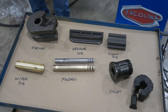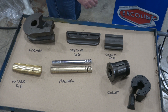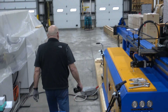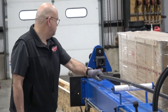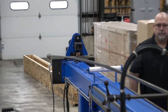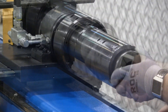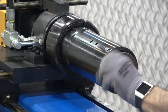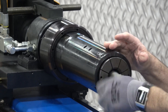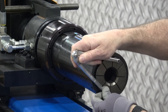First, we're going to go ahead and mount the collet in the machine. All the tooling is off the machine and the area is open. I can mount the collet into the tailstock. In this case, ERCO 65, I'm going to take this collet. I'll go to the rear of the machine first and pull the drawbar back so I have room to get the collet in. The collet is going to thread into the tailstock with a very fine thread. There's a spanner wrench that we supply with the machine to tighten the collet in position, using the spanner wrench pin-hole locations to lock the collet in.